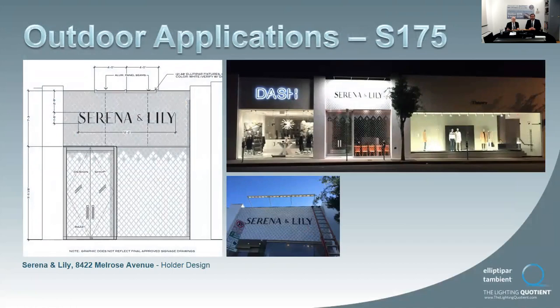One of the popular applications for the linear 171, now 175, has always been signage. And unfortunately, a lot of these installations are 1, 2, or 3 fixtures. We often don't get professional photography. That's again the case here. These cell phone shots come to us by virtue of our local agent and the installer in Los Angeles. But you have a target area here that was essentially just shy of 8 feet high and about 15 feet wide. The architect was originally looking at a pair of fixtures, but because of the width of the lettering and the overall backdrop, ultimately opted for 3 4-footers.